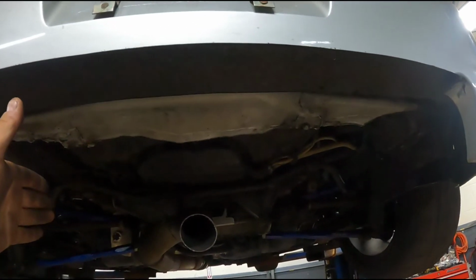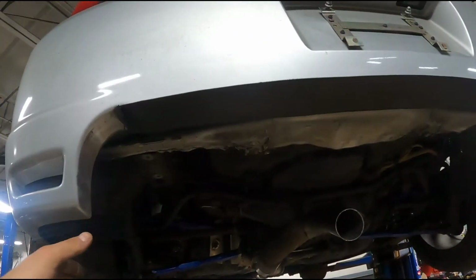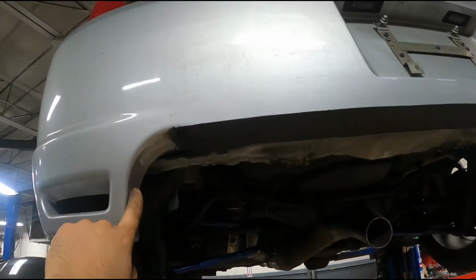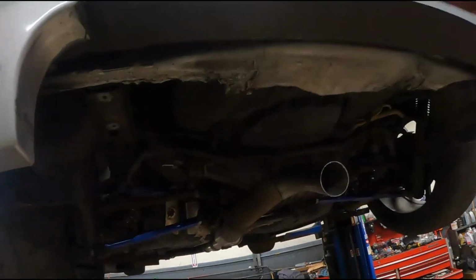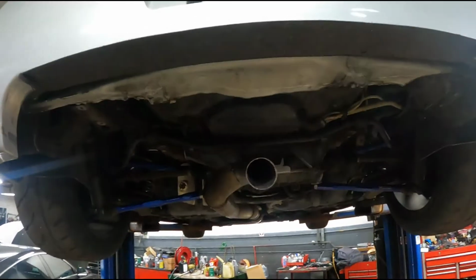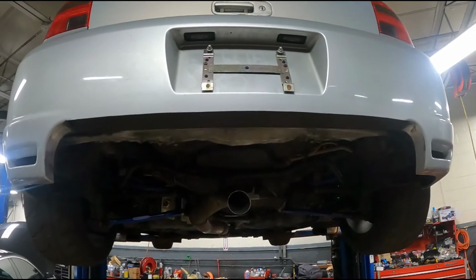I'm just going to use a brake, bend it down here, down on this side, and then for the outer portion of the diffuser I'm thinking of using ABS plastic, so that I can bend it with a heat gun to match this profile, so it looks nice. It's not going to see a lot of heat there anyways, and then just match that same angle as the steel one all the way down and attach it somehow. I'll rivet it or something like that, but for now I'm going to just mock up some cardboard here and show you guys what I'm talking about.